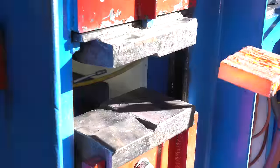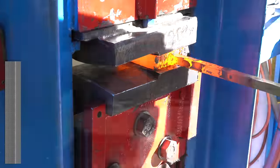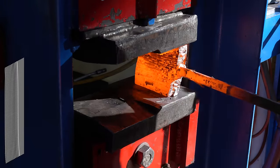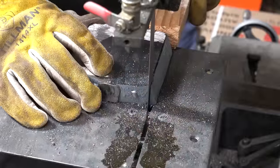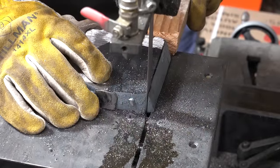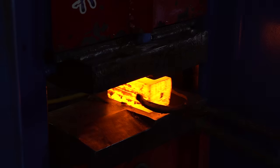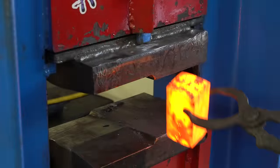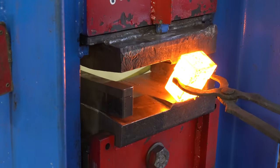Back at it the next morning — we've cut up that one-inch bar into five pieces, stacked it up tall, and now we're forge-welding it together. Rick is pressing on an angle to purposely put a rhombus into the billet, which will give the waves a nice angle to them. Now we're cutting off those rhombused edges, then cutting the billet in half so we can mirror it and forge it back together. Here's what happens when you run out of propane on your big bottle — you've got to put it in water to keep it from freezing.